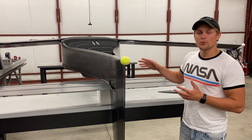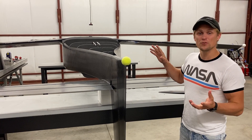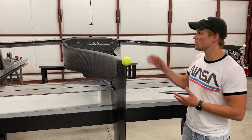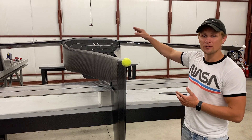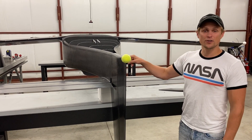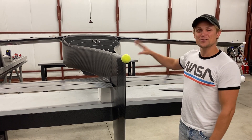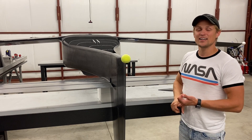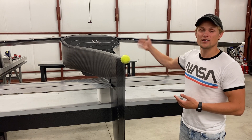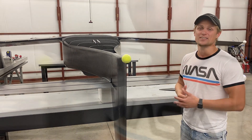As far as how you're going to receive the kit, we're thinking two main sub-assemblies. One would be the wing kit, the other would be the fuselage kit. The wing kit is going to include all the flying surfaces and control surfaces: the wing, the flaps and ailerons, as well as the horizontal stabilizer and elevator, and then the vertical stabilizer and rudders. The fuselage kit would include the fuselage structure, as well as the landing gear, engine mount, canopy, cowling and spinner, as well as the hardware for the control system.